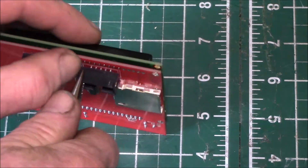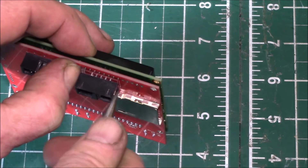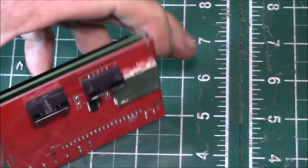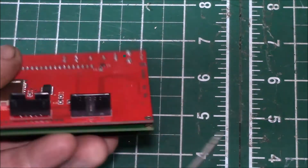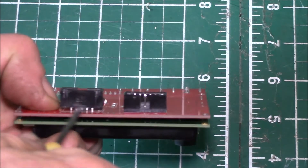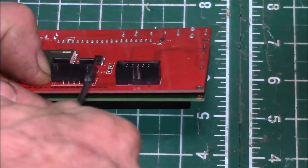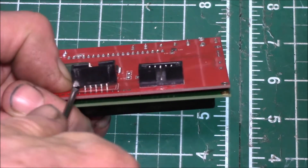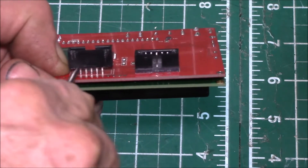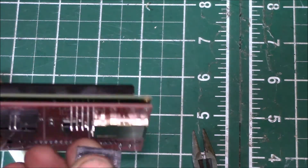You can see I've got that connector up a little bit. It takes probably a couple of minutes because you can't pull it very far — the connector shell will rock on those pins. Let's work a screwdriver in there. You can see the connector shell moving. You just want to go a little bit on one side, a little on the other side.